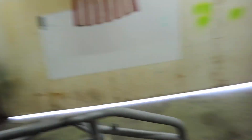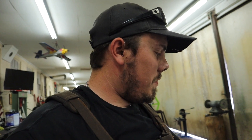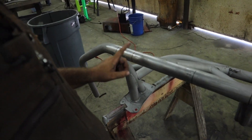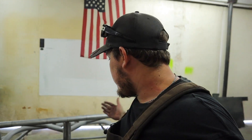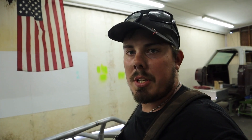I went ahead and welded this up — not pretty, but that's fine; it's actually going to get ground away for the most part. I'm also going to move the shackle mounts over and weld the shackle mount on top of that to strengthen this piece here that cracked. And I'm going to put it on the same place on this side over here. Everything else is relayed out, because I did end up taking my reference lines off — I wanted to do it properly, clean up the tubes, make it look nice, and just go the extra mile to make sure everything is good to go.